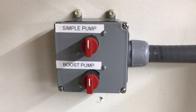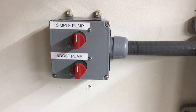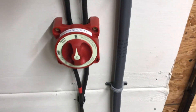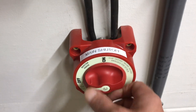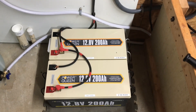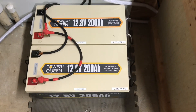The boost pump ties into his existing plumbing and fills the tanks, so it's just like having your regular well pump — you wouldn't even know the difference. Here's a view going down on the system showing all the components. Here's the main disconnect for the batteries — this is the main shutoff when you run into an issue or need to service everything. You just kill that and everything's off.